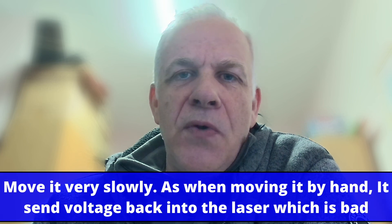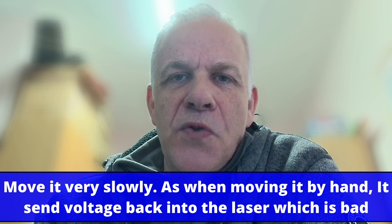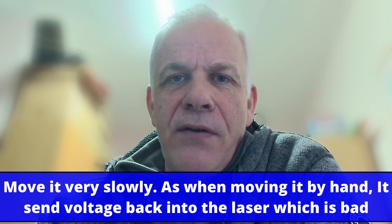I hope you found that video useful, especially if you're new to laser engraving — it's one of the vital things to adjust correctly on your laser as you're starting. It's also important during your regular maintenance when you check that the smoke protection lens isn't fogging up and you clean it with isopropyl alcohol and when you check your belts — it's good to check your laser carriage too. Slowly move it left to right and feel for that bump every 50 millimeters or two inches.